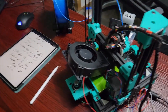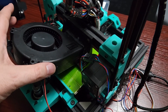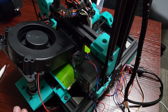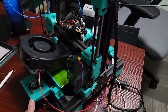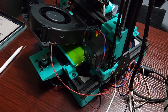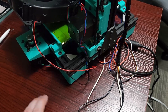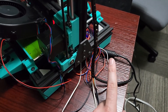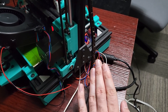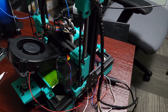Coming around the back, just for fun, I made a mount for one of these large 120mm fans for extra cooling — just for hilariousness. I haven't even run out of cooling yet and could probably print much faster. We can see the Y motor on the back here; there's a little limitation with the Y motor height, but you could print standoffs for the feet if you wanted to raise it up. I am using an AC adapter here — I literally just cut the end off and wire it right into the mainboard, so we're only working with 24 volts, no 110 volts. Very easy for beginners.